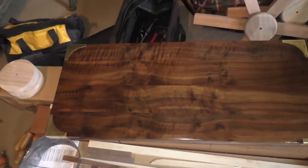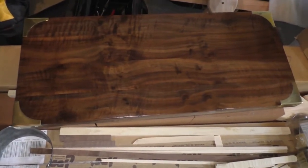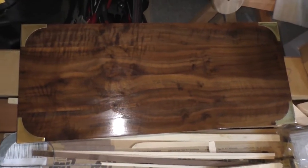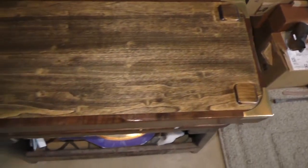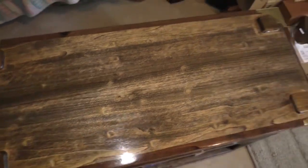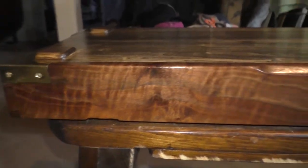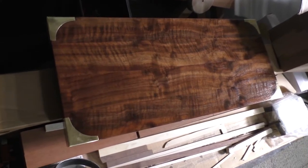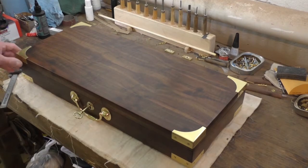This is the top after two coats of true oil. The first coat saturated under the corners and where all the inletting has been done. Then I rub that down with steel wool and put the second coat on with the corners on, because oil will go into any spaces and seal it all up. Here's the bottom — it's poplar stained with special walnut stain, and the rest is not stained. I like the colors in the wood and the figure — these are the natural colors. That's the third coat of true oil. About four coats total, five on the top, rubbed out in between with ultra-fine steel wool.